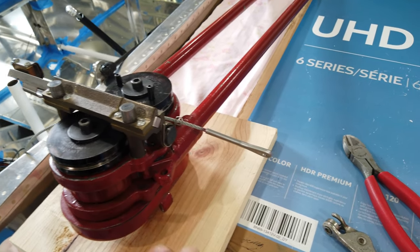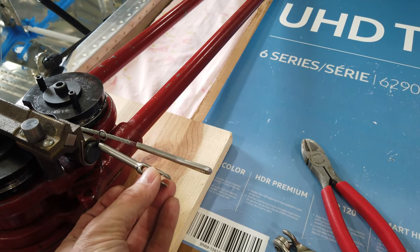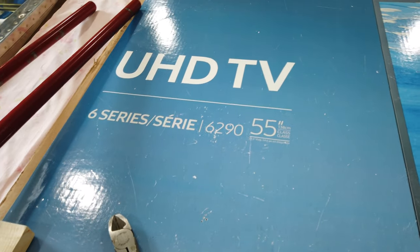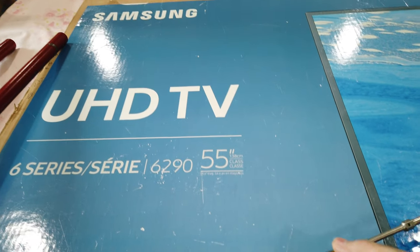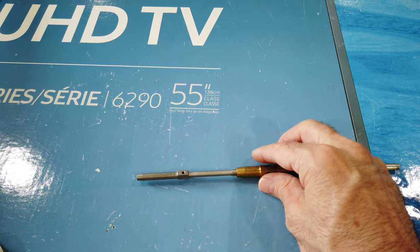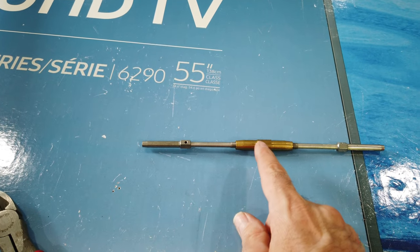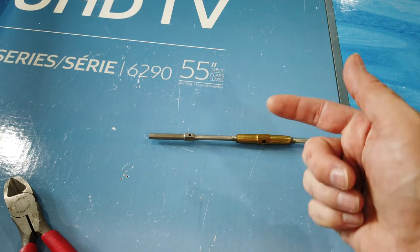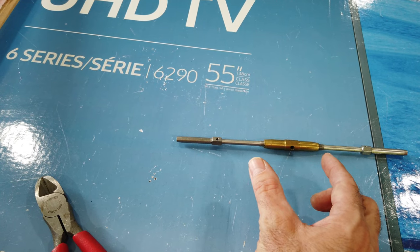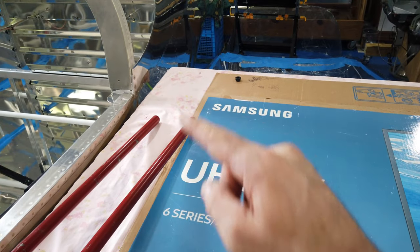Since I've got my own swager, I can make up my own cables. The cable is going to end up a little bit shorter because I have to cut it and add the fork fittings on both sides. But I'm okay with that because the other modification I'm going to do is install a turnbuckle on the system — just one turnbuckle is all I need. Once I have both forks in place and splice in the turnbuckle, I can use it to adjust the overall tension on the system.